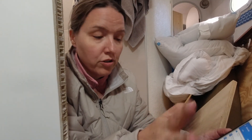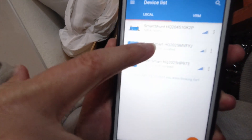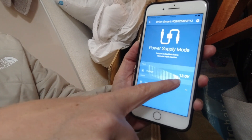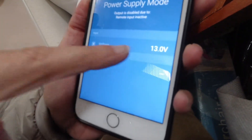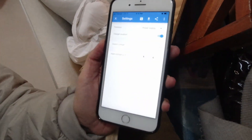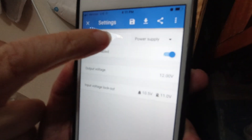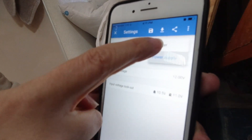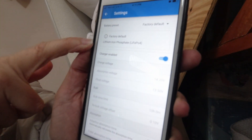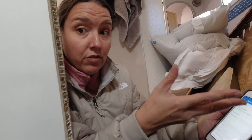We have the Victron Smart Connect app where I can see our smart shunt and battery status. The Orion smart units also connect - the one I haven't programmed yet shows incoming voltage from the engine batteries at 13 volts. We haven't connected the output yet because it told us not to until we programmed it. I need to set it up for charger mode rather than power supply. When I changed it to charger and went into battery settings, the factory default is lithium iron phosphate, which is what we have - so we're set up for the proper battery system.